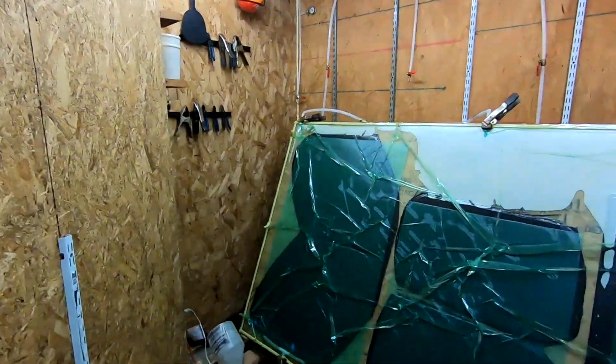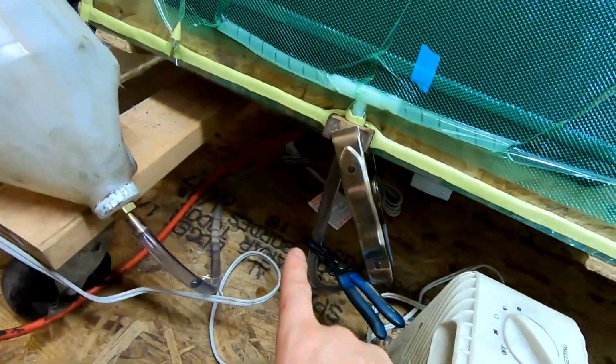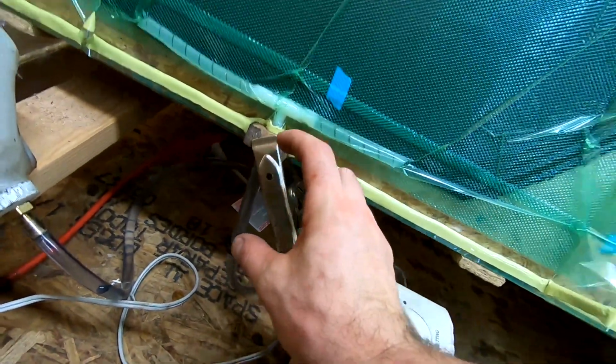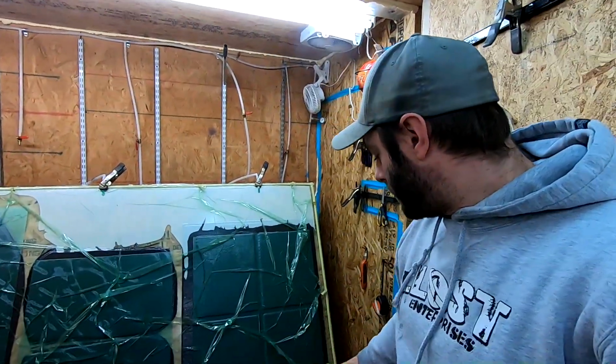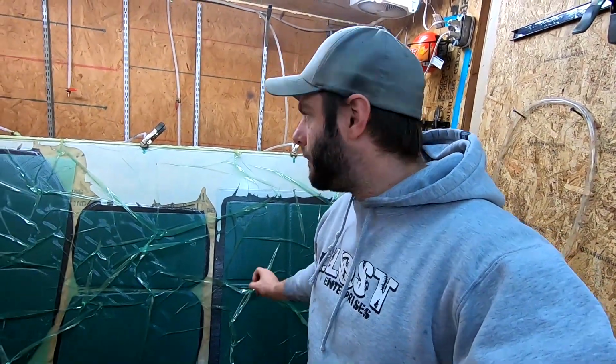And you have to remember that inside of the infusion lines, this little bit, and just the fabric, when you infuse parts like this, especially thick parts, they almost relax a little bit. So a little bit of epoxy volume is in each of these parts. So when you pinch off the line, that vacuum pressure will still squeeze and consolidate those layers, and the epoxy will make it all the way up.